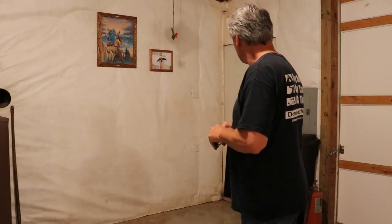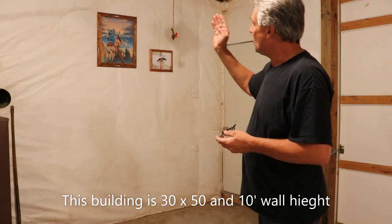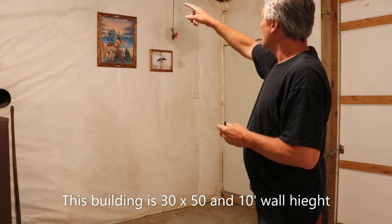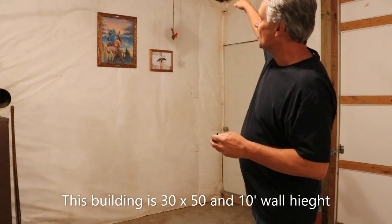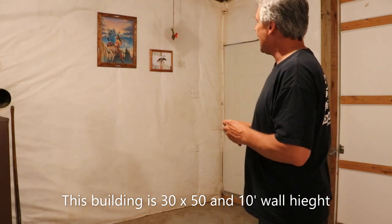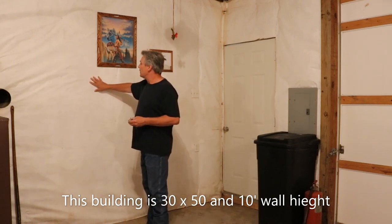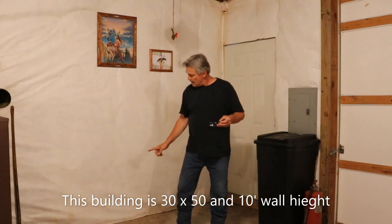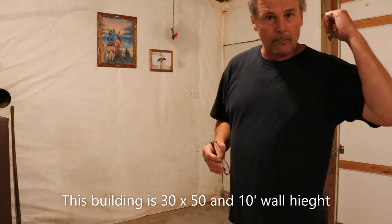Let's move on to the walls. The six-by-sixes, when they built this building, were on ten-foot centers throughout the building. I simply put a pressure treated bottom plate on and put studs on two-foot centers with a top plate nailed into their band board. That helps give us a stronger building because now we're supporting all the way throughout. It also gave us means of stapling our insulation, which is six-inch fiberglass insulation with a paper back. On our bottom plate, we stapled the quarter-inch by six-inch band wrap — just like we showed you on the door — to help seal up the bottom plate.